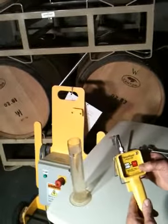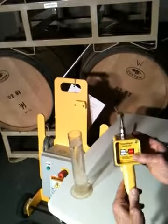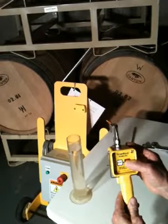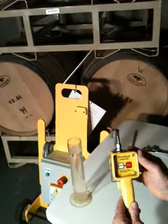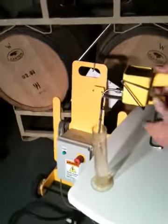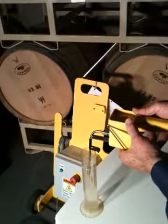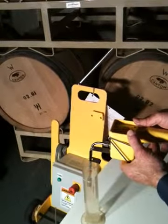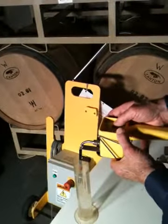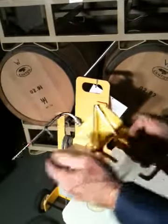So now what I want to do to go into the calibrate mode, and all this information is in the owner's manual, we press and hold the stop button and hold it down, and it flashes red 5 times and stops flashing. Okay, so now we're in the calibrate mode. From the calibrate mode, we need to have a level of liquid in order to calibrate it. So we're going to immerse the sensor down inside this liquid container. This is like a graduated cylinder. You could use a lab cylinder. And as soon as it reaches the red band, you hit the stop button, and that sets the level. Okay, so now it should be calibrated to operate on and off.